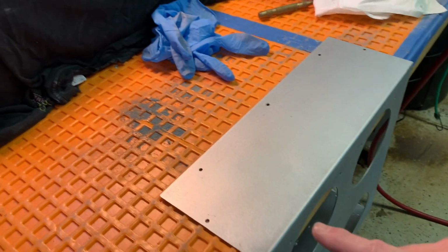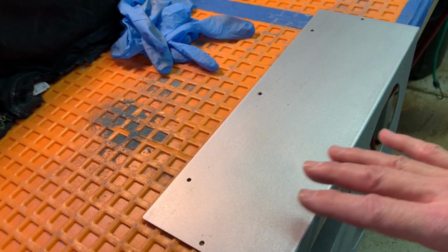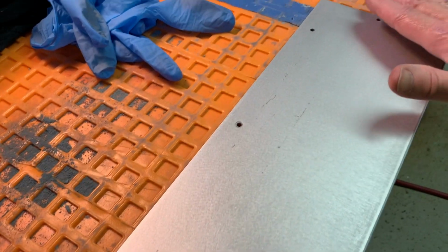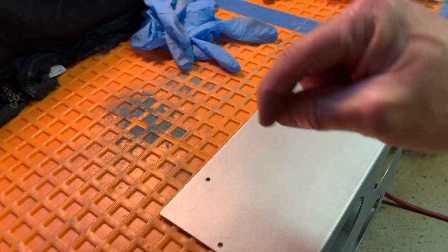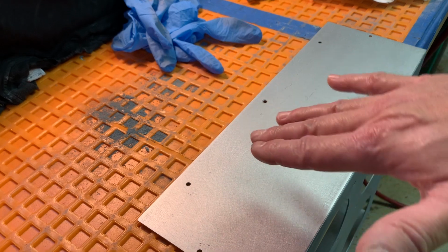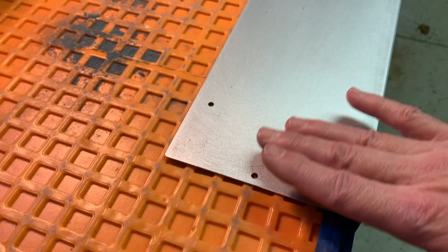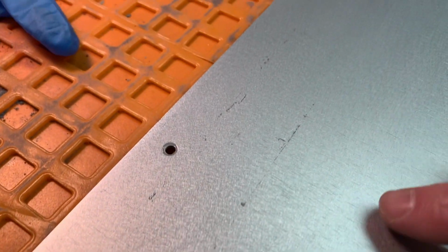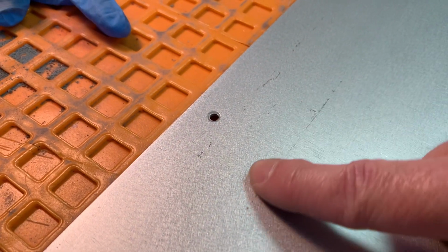Okay, so I know it seems kind of crazy, right? I covered the whole thing, beat up, and then I basically sanded it all off. And the theory is, my disc sander can only go flat on this metal, right? So any scrapes, gouges, and dents would be filled in with that feather fill, as I call it, the spot putty. And I would sand all the excess off, and those spots, see how you can see them? The theory is they're smooth now. They're filled in.